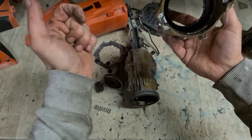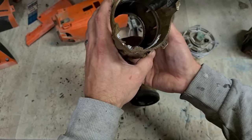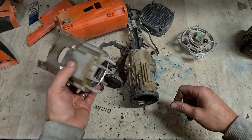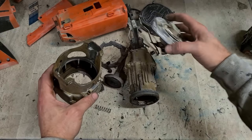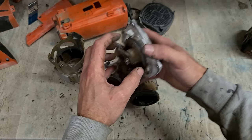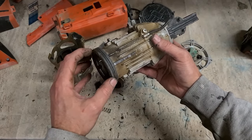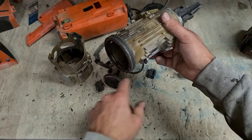There's where the dirt's getting onto. Inside the actual firing chamber. So that's going to be fouling up and sticking to the O-ring, causing that to get very tight. Keep jamming here on this one and on this one. Even though this one might be a wee bit tight, you should be able to overcome it. When you actually plunge this down, this actually seats both O-rings together. So you actually have to overcome the dirt on both of them.